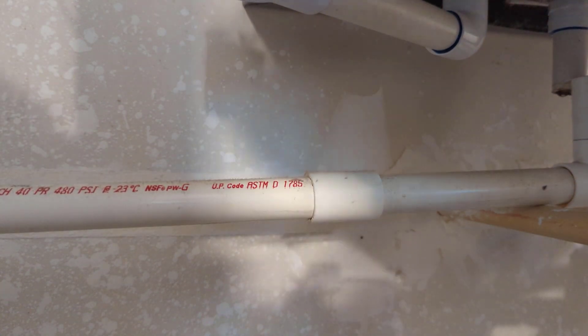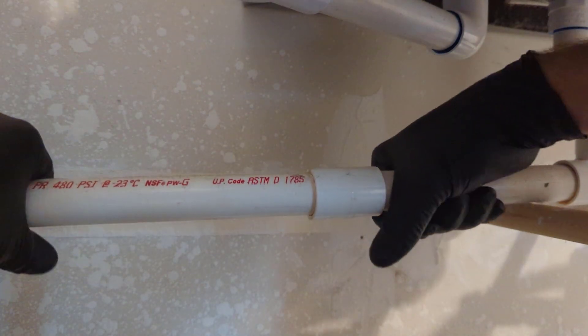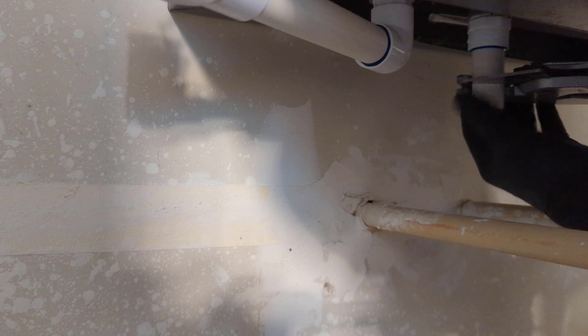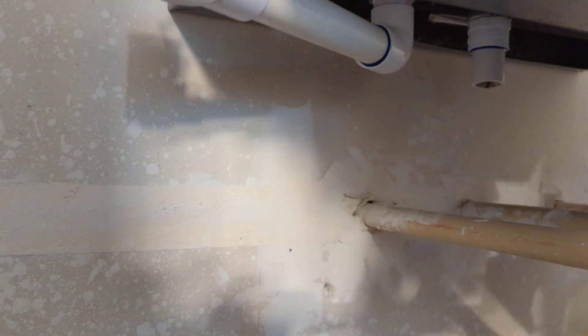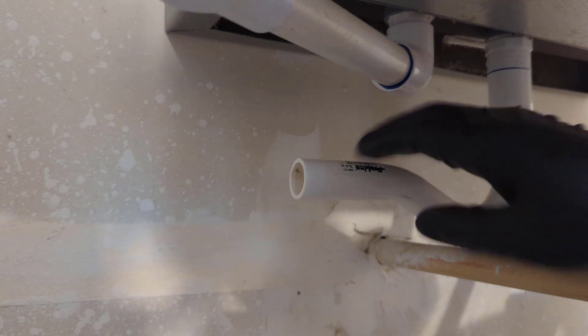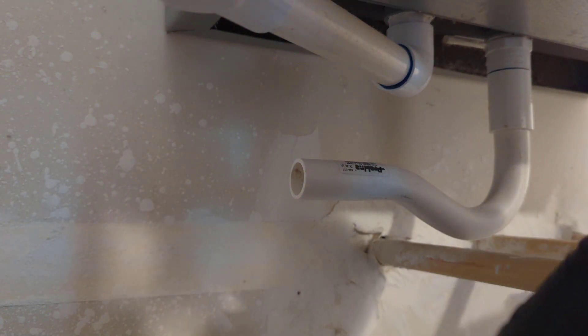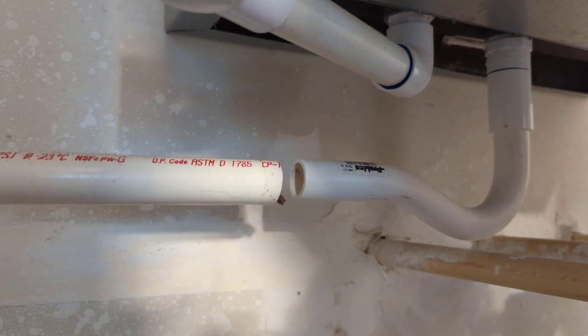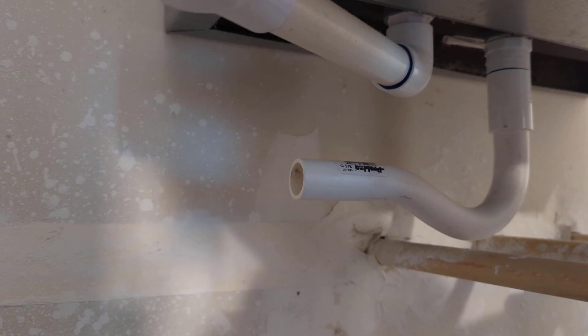Okay, we removed that piece and I'm sure this isn't glued in as well. Cut this up a little further, got the coupling — slide this up on and it's going to go above the pipe and it will raise the rest of the drain that was here. We'll put a coupling over here and tie into the drain. Let's get this all prepped up and glued.